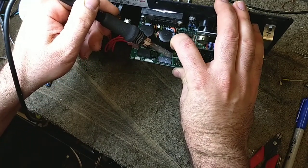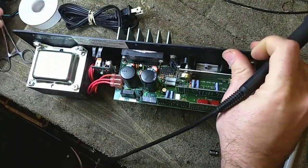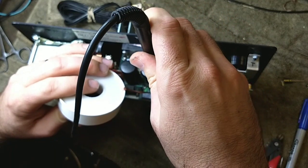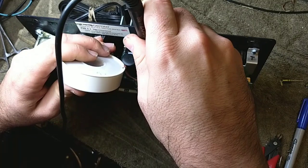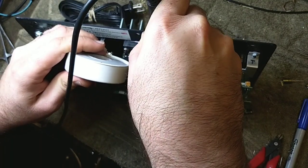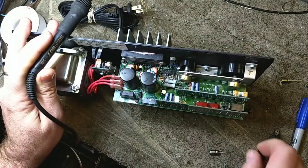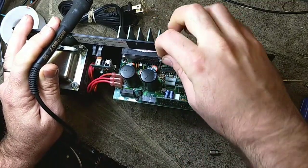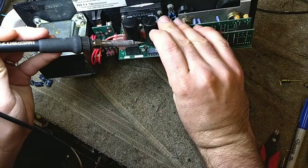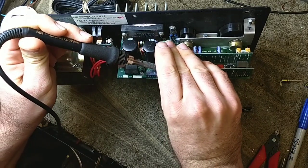I apologize for the silence — I'm sure you guys don't want to hear me babble all day either. That one's going to be really stubborn. What I'm going to have to do is get some solder wick in there and see if I can wick up the solder on the pad. That's why I don't like these boards. Alright, so we finally got that nightmarish capacitor pulled through.